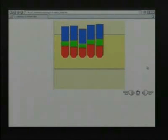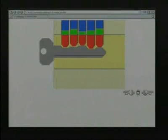You'll have a lock that's pinned out something like this, so that all the red pins, all the key pins, and these aren't the real colors, by the way. Don't go home being like, hey, my locks are brass. No, these are just for demonstration. All the key pins are different in every door so that everyone can be issued their own key. But in every door, the additive combination of the bottom key pin and the master pin adds up to the same number, so that you can have a user's key, the lowest key on a totem pole.